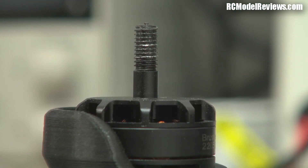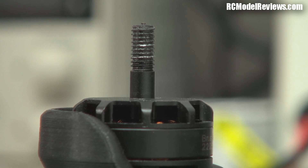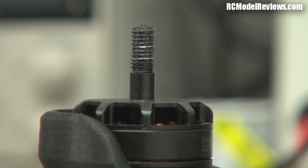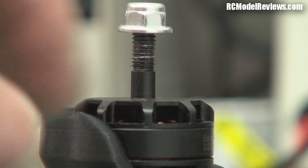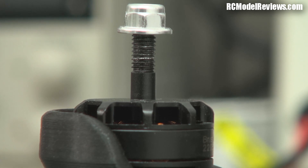I managed to get the nut off and this is what happened. It looks as if the nut and the thread have galled. What galling is, is a form of cold welding. When you have similar metals — especially aluminium — and apply a little bit of pressure with two bare metal surfaces together, they actually cold weld together. Now, normally nuts like these are anodised, and so is the shaft on the motor. The anodising is actually a ceramic — it's very strong and provides a barrier to stop the bare metal parts touching. But if the anodising isn't done properly, it breaks down and you get metal on metal, which means it just galls up and jams.